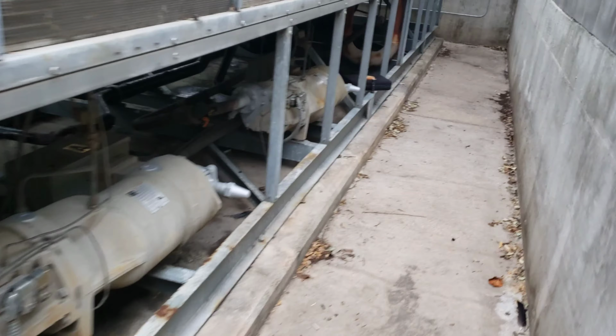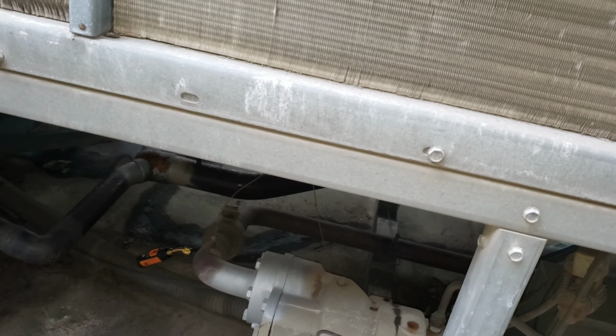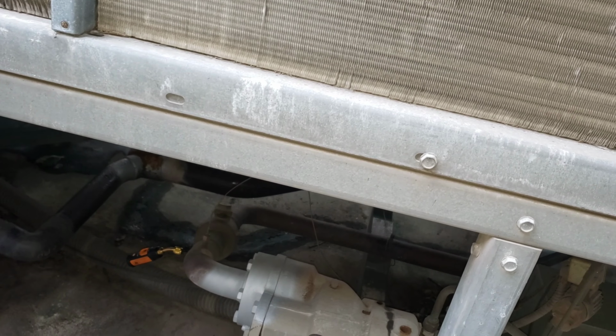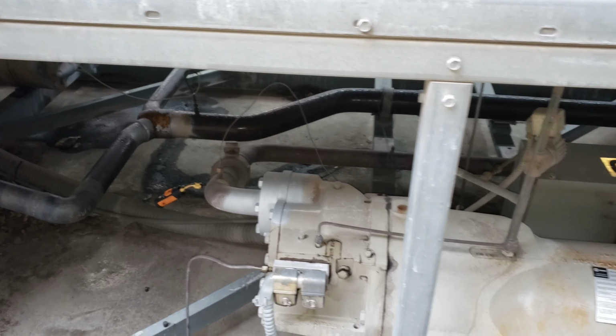All right, so that temperature just continued going down. It was at 43 just a second ago, 43, 42, where it cycles at. We never got below 140 amps on that compressor. So we're gonna get some magnets out. These solenoids are trying to activate, and we actually got some magnetism on them, but they're just not doing it. You can just tell that's been leaking. So that's another thing we need to address. Anyway, that's where we're at now. We need to troubleshoot these unloaders, see if we can get that slide valve to operate. If not, that's going to be our problem, the unloading.